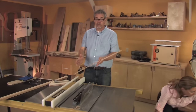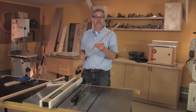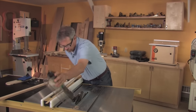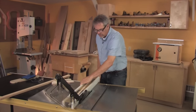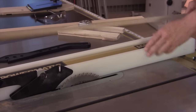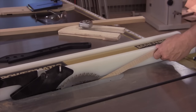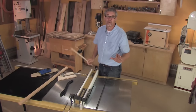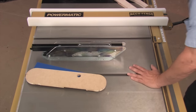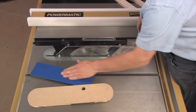Going from a super easy rip cut to something more challenging — let's say you want to cut thin strips of wood to edge plywood. Even getting the saw blade that close with the guards in place is a challenge, and thin strips can slide through the insert, which isn't safe. But we've got a great solution: part one means putting in a zero clearance insert or throat plate. You can buy them or make your own.